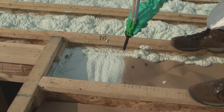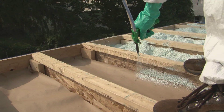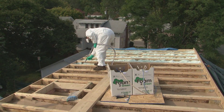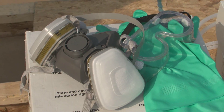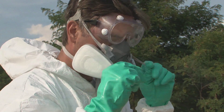Soon I'd figured out a simple technique for applying a fairly even coat. The foam goes on wet and then quickly expands to fill cracks and gaps. Within a couple of minutes it's fully cured, but I could go back over spots I'd missed to add more foam if I needed to — 5 minutes or 5 years from now. While it's important to wear proper safety gear while applying the foam, once it's cured there are no VOCs and no formaldehyde like spray foam used to have many years ago.